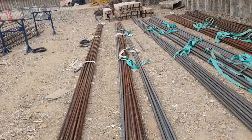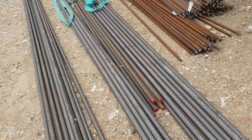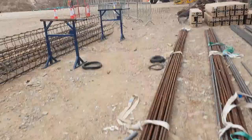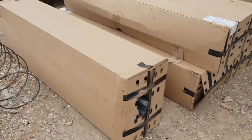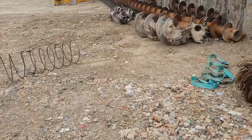These will be used later for the testing piles — I'm going to show you the testing piles when that takes place on our site. You guys are drilling 600 piles now. On top of the bar there is a foam inside — it's called the debonding foam — which later allows you to break the piles properly and get them ready for the pile caps.